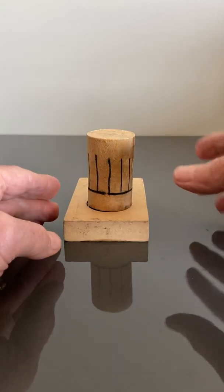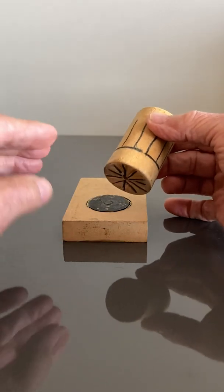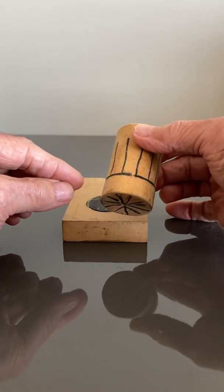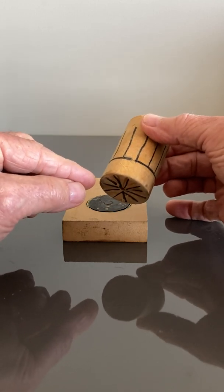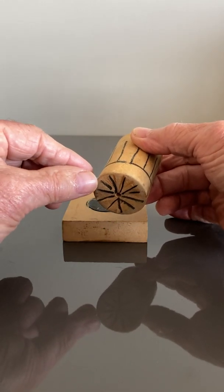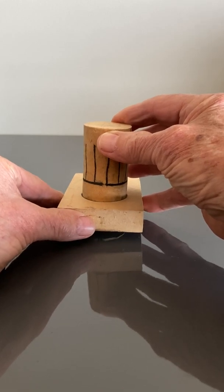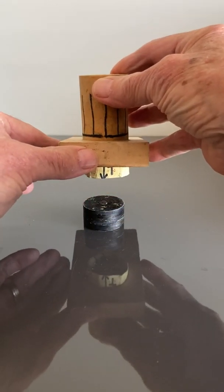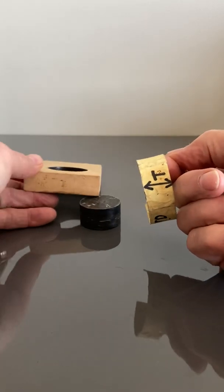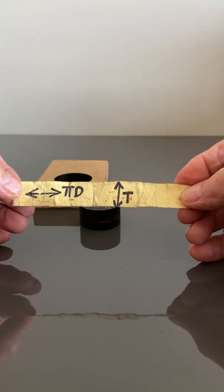I've made this punch out of custom wood so you can see that is the punch and we're punching a circular hole here. Normally you've got relief at the back here so you don't get pick-up on the punch as it goes through the metal. The cutting surface is this perimeter around here and that's generally concave to give it a sharp edge. When the punch is forced through the metal, you get the waste coming out the bottom and the shear area is this area here — it's the perimeter of the hole, and it can be a square hole or any shape hole.